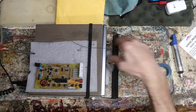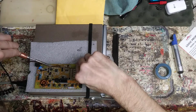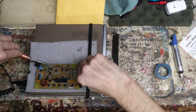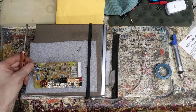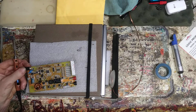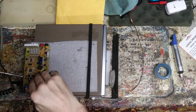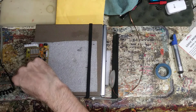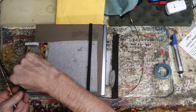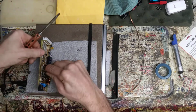That black stuff looks like burnt board and all that, but it's actually not. It's actually the flux. I really should get it cleaned off, but I'm so close to being where I want to be. Oh, that one don't want to come out. Where is the pen? What size? Do the pin trick. Get in the hole. Gotta get it in the hole. Heat it up from the bottom and then come through at it. Once you get it through, you just wiggle it.